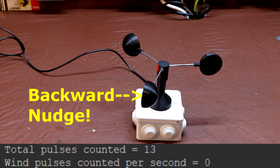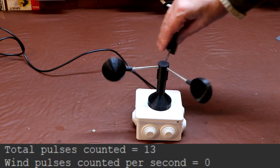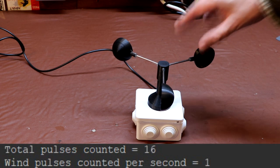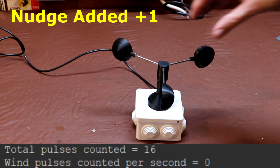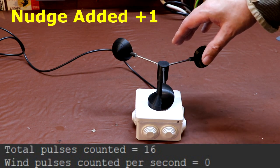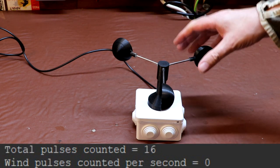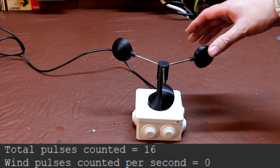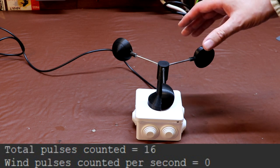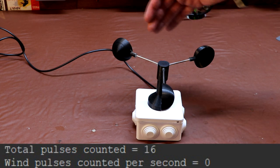So we're at 12 pulses, stroke 13. Let's keep going back to the 180 position. Now I was expecting that to be 15 pulses there, but obviously I've gone a little bit too far, or I've wobbled. And really I've just demonstrated the problem here in that when I was trying to rotate the shaft carefully, I've either gone a little bit too far or I accidentally pushed it backwards.